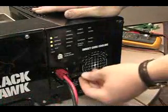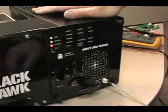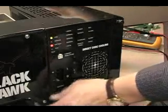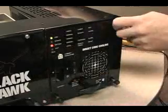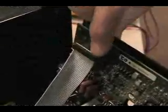If you need to remove the inverter module, turn off the battery breaker and remove the battery wire harness. Remove the temp sensor. Unscrew three panel screws. Slide the inverter module forward, undo the two latches, and remove the ribbon cable. Then remove the inverter module.